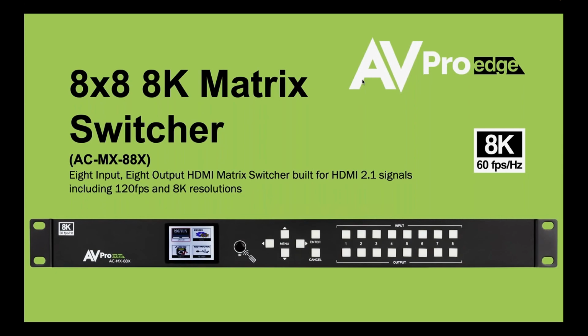It has a screen, has some menus, and then has your inputs and outputs that you can select as well. But this is going to be built for 40 gigabits per second. It's an HDMI 2.1 device, so it's able to handle anything under FRL5. That includes 4K at 120 frames per second and 8K up to 60 frames per second.